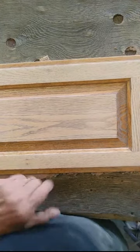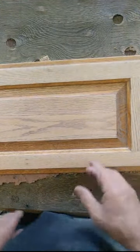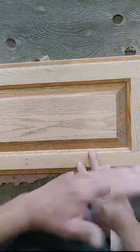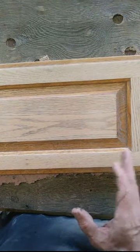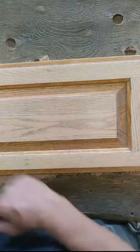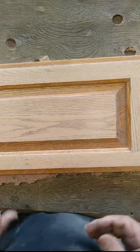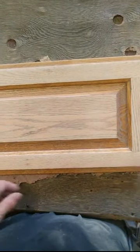All right, I'm telling you the inside tricks now, guys, gals. So if you want real dark grain, hit it with a light walnut or a dark walnut, go over it immediately, wipe it off the surface, let it dry. You may, if you want, then kind of hand sand or quickly palm sand with a 320, go over the surface, clean it up, then go back over it with your golden oak, and your wood grain will really stand out really nice. It'll be enhanced and you'll have a custom stain job. All right, that was for free.